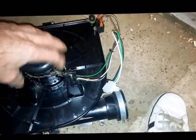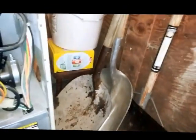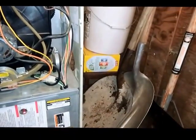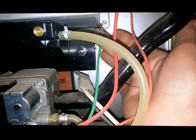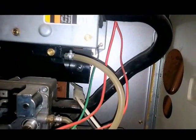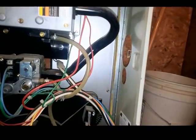If you do suspect that your piping is blocked, what I like to do is hook a vacuum cleaner in the blow position down here in the basement and blow out of the pipe. A lot of times that mouse nest will blast out with the vacuum cleaner pressure. If you do have a plugged intake pipe, you can typically just pull the pipe off where the intake attaches to the furnace. Once you separate that, if you do have a plugged intake pipe, your furnace is immediately going to turn on the igniter — you'll see it going orange — and that would definitely indicate that you've got a plugged intake pipe.